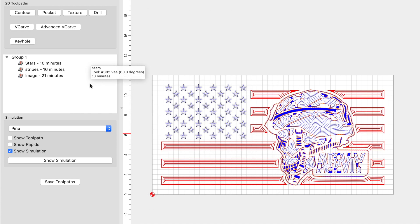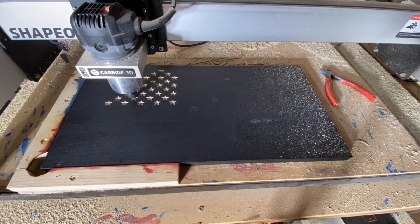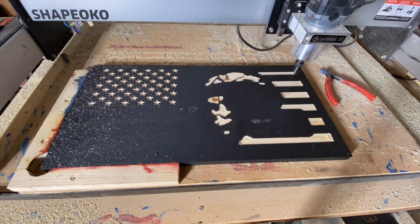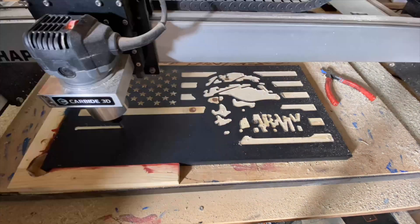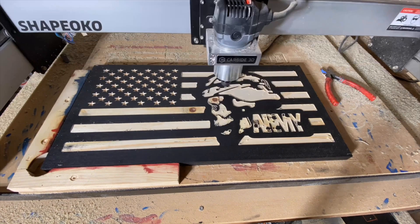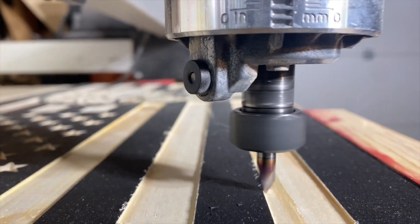So now that we have everything set up, let's go ahead and take a look at our simulation. And there you have it — you have a nice looking flag. Now with the toolpath set up, let me show you a time-lapse of this being carved. In this time-lapse example, the stripes and image were saved as one single toolpath. Since the toolpath settings were the same, it can be saved as a single toolpath rather than two. My default is to set up two different toolpaths, but if you're in a time crunch as I was, using one toolpath can save you time. Carving stripes with an advanced V-carve may take more time than if I were to just use an end mill, but I really like how the 60-degree V-bit creates sharp corners on the stripes.